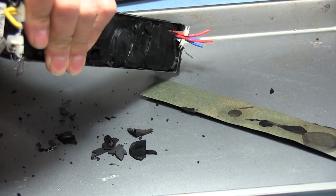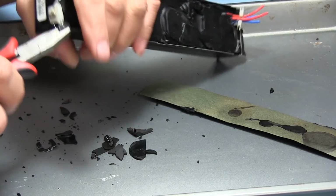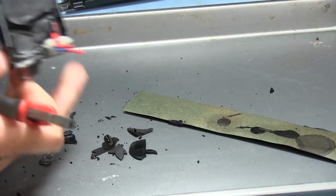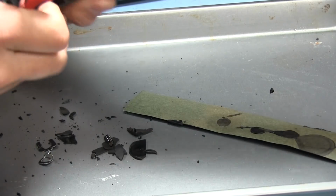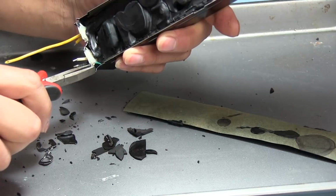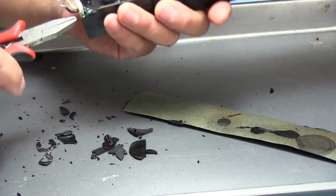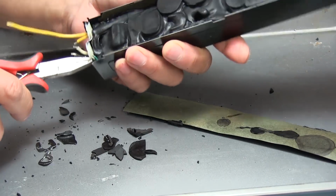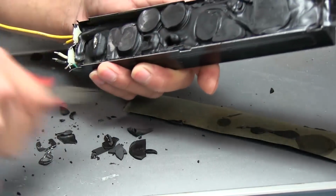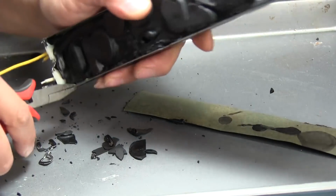They've got these little grommets on there to protect the wires from rubbing on the sheet metal and potentially causing shorts. If we look over, oh yeah, it's actually right here. On this side, there is a green wire that's just kind of there on the corner, but that is actually a grounding wire, and it's pinched in between the layers of metal there, between the back cover and this top cover here, so that basically makes the whole thing grounded. So that's what that's doing there.